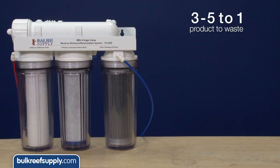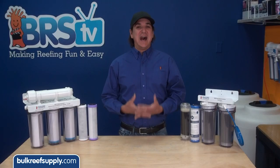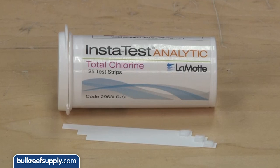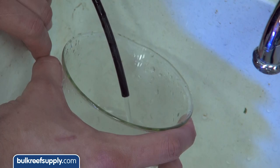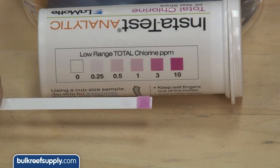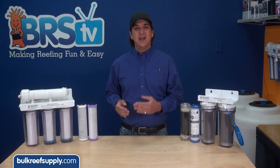It is also important to remember that the rating on the side of the filter is for water that passes through the carbon block, not water the RO system has produced. A typical RO system operates on a 3-to-1 to 5-to-1 waste-to-product water ratio, so 100 gallons of water from an RO system means the carbon blocks actually filtered anywhere from 400 to 600 gallons to produce that 100 gallons. So our suggestion is to not rely heavily on the volume ratings on the packaging and instead start using cheap, simple 5-second test strips, replacing the filters when you detect an unsatisfactory chloramine breakthrough. The easiest way to test is to run your system for at least 10 minutes and then test the wastewater with a total chlorine test strip, which will detect all of the chlorine and chloramines in your water. Wastewater is a good place to test because it has passed through the carbon blocks but is not filtered by the membrane itself.